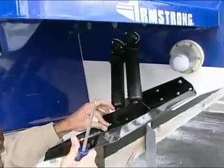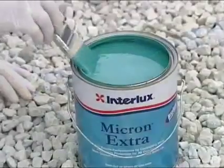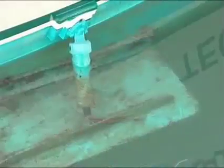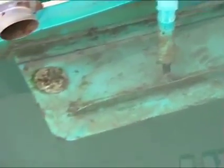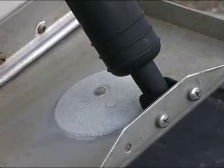There's not a lot of maintenance that you have to do on the trim tabs. You want to keep them clean like the rest of your boat. If you want to keep the growth from accumulating on your tabs, then you put anti-fouling paint like you do on your other underwater appendages. What about sacrificial metals? Well, if you're keeping your boat in seawater and not trailering it, then we recommend that you put zincs on the tabs.